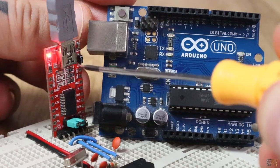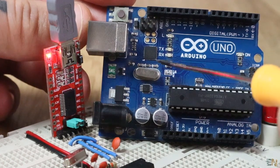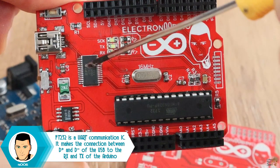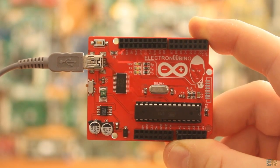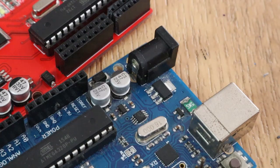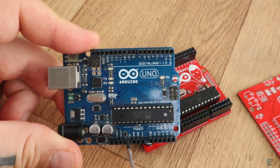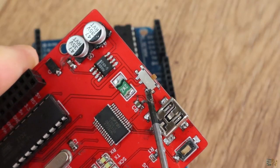As we've seen, I had to use an external FTDI module to program the ATmega chip — my board will have that included. This IC makes the connection between the USB data and the ATmega 328 so we can upload our sketches. We also need a 5V voltage regulator, a USB plug, a reset push button, female pins all around for digital inputs and outputs, some extra capacitors, LEDs, and a switch.